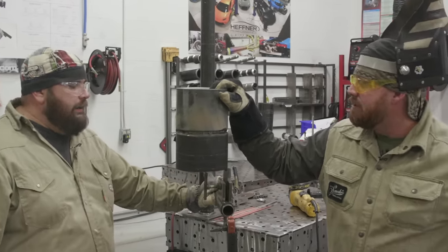Okay. So right after this, we'd obviously clean this out and then we'd follow it up with another 6010 pass or now, go right into 7018. Where I come from, now this differs where you're at, you're gonna run 7018 now. Okay. There is some places and procedures that would want you to run a hot pass after that. Okay. And that is actually a hot pass at that point. And this is bumping up like another 5-10 amps and then throwing another pass in there? Depends, you know, the guys that run it all the time, they're probably bumping up 10, 15, 20 amps.